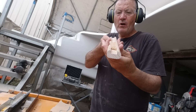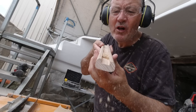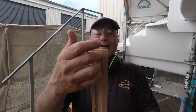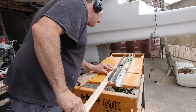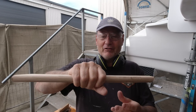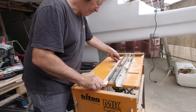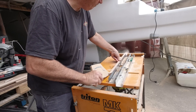I've routed a slot down the center and rounded the outsides with a semi-circular router bit, top and bottom. I'll router a 16-millimeter slot through the center so it sits neatly on top of the foam, then round off all the edges. This is for the top of the galley, and I also want it to serve as a handrail — so if you can grab hold of the top as you go up and down the companionway, why not? I'd rather not have sharp edges wherever I can avoid them.